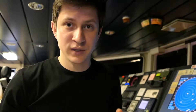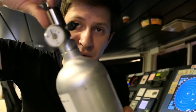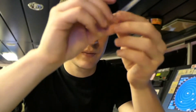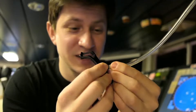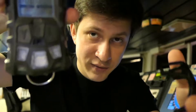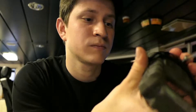Once we have made sure that we have the right cylinder, the next step is to connect the flow regulator to the top of the cylinder. Once we've connected the flow regulator with tubing to the cylinder, we need to connect the calibration cup to the other end of the tubing. It's a bit tricky — the most difficult part — because the hole is so tiny. Then you fit the cup into the gas analyzer on the side below the screen, the side with buttons, like that. You'll hear three sounds because there are three flaps.